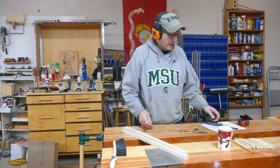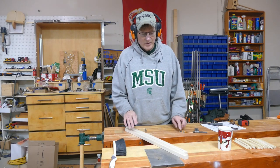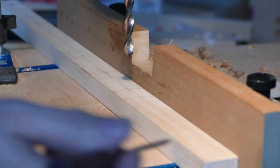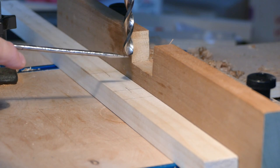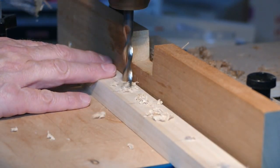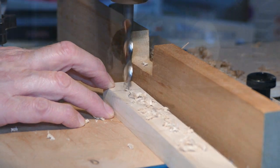Really, you could just use a regular hand drill with a drill motor. What I'm going to use actually is my drill press. I've set this up so I can drop the center of the drill directly into the hole that I left. Now, be sure whenever you do this, you test the hole size — the three-eighths is not always three-eighths. I'm actually using a 23/64 inch drill, so it's going to be a little bit tight, but it's better than being too loose. I'm going to drop these in for about three-eighths to a half inch deep.